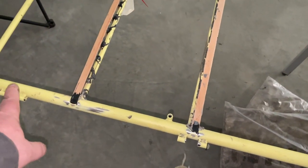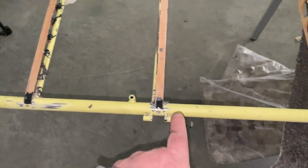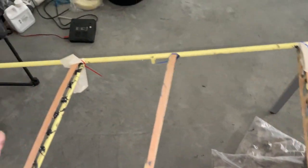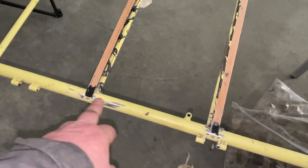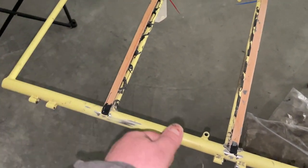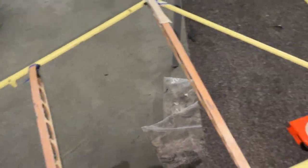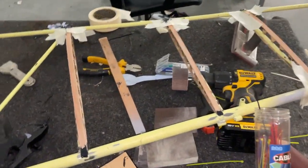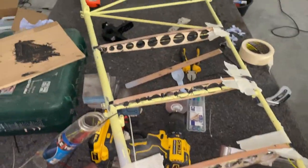And so what I'm going to have to do now is, when I've actually primed this, I'll need to go over with two-pack. So I'll be spraying it. Well, we'll undercoat that, and then I'll probably just two-pack over the top of this paint and over here, just to provide a hardened, well-attached surface for the glue to stick to. So that's going to be another job.